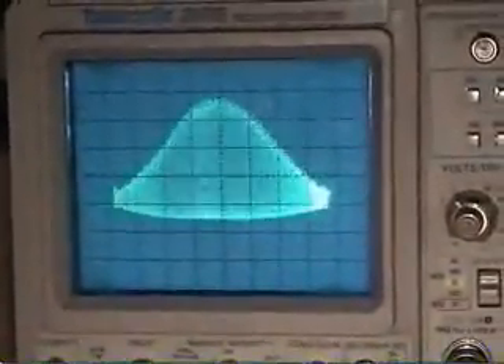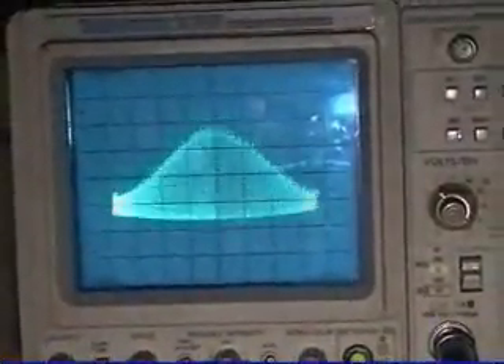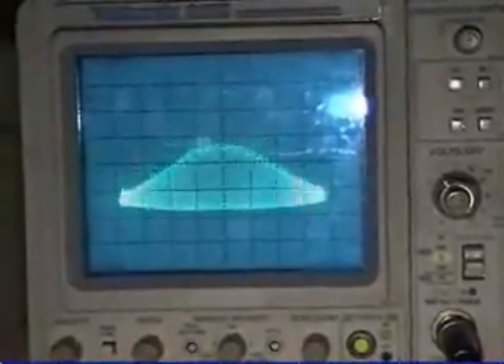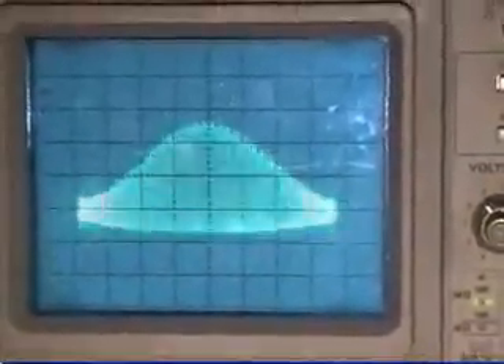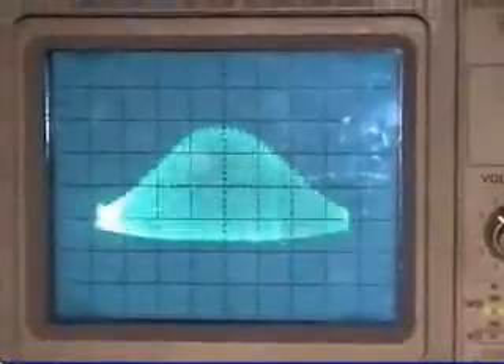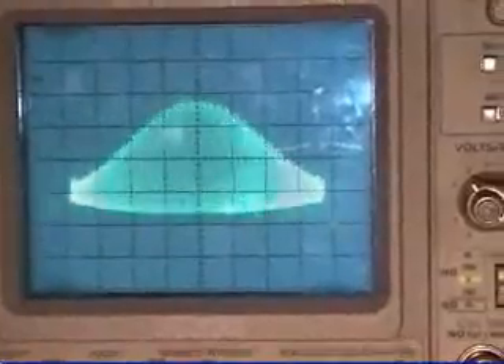If I play around with my laser — it's a very sensitive nonlinear polarization rotation mechanism — you can see that I can increase or decrease the quality of my pulses by changing some of the adjustments, and the autocorrelator helps me do that. Here I'm playing around with the pump power, dancing right around threshold, and we can see that the trace will come and go depending on whether or not I'm above the mode-locking threshold.